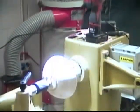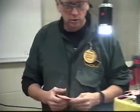What's the soonest you can recoat with Danish oil? How long do you have to wait? It kind of depends on what you're doing. If I'm going through my steps, I will probably recoat once in a while. If it's real nice drying weather, maybe 2 days, 3 days. But typically I get the best results if I wait 3-4 days to a week.